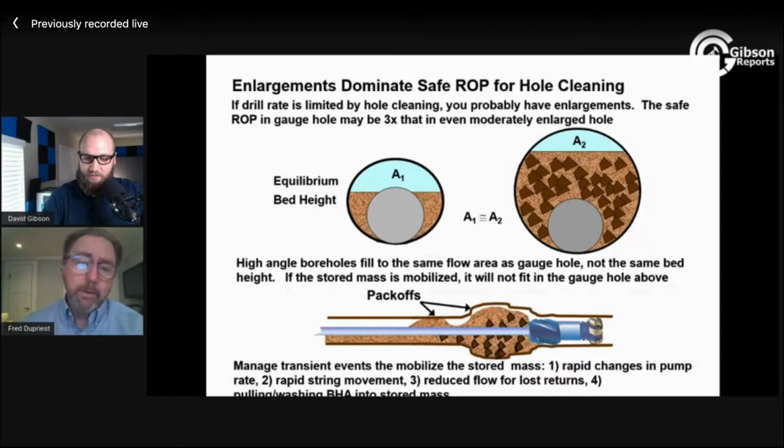What we want to do, and it's a priority, is teach whirl and how to manage it in real time: how to identify it, do an RPM step test, identify when you're at a resonant RPM, and forget your hole cleaning priorities. Your number one priority is not to be at one of those resonant RPMs. So maybe you identify one at 80 and again at 100, not at 120, fine, do 120. But if you're resonant at 120, I'd rather be at 80 than that.